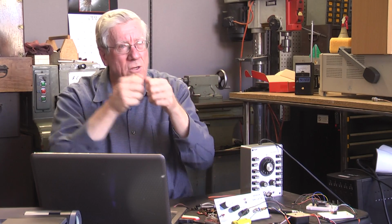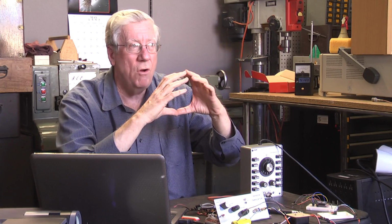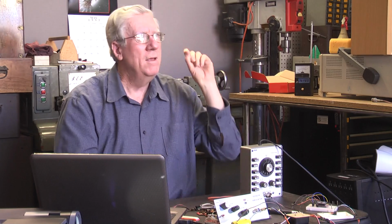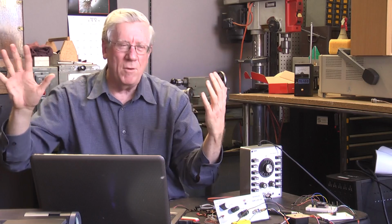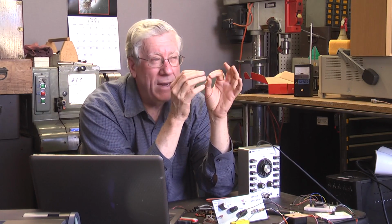Now, he modulated an RF carrier with this megahertz of noise. Oh, by the way, the value is kind of interesting. The value for each one is the middle two digits of 1,400 phone numbers from the phone book in the area that he lived in. And now he had two of these discs, one on the receiver and one on the transmitter. Now, as some of you know, if you spin something that fast and it's varying, you get megahertz of what appears to be noise.